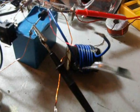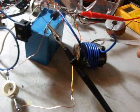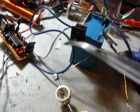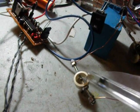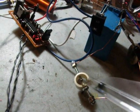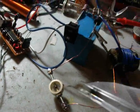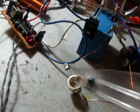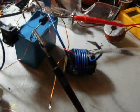The coil, as you can see, is a little bit unusual because I wrapped a few turns of wire over it. The reason I did this is that 800 volts from the main capacitor is not enough to trigger this spark discharger. There is around 1mm of air between the electrodes, so to make a spark between them and make this area nice and conductive, we need a higher voltage. To do that, I use these turns of wire.